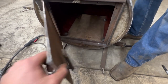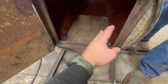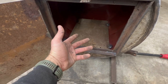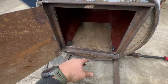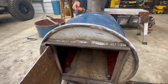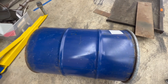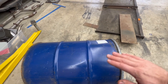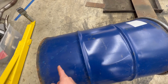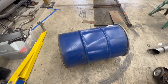We tacked a plate steel piece on all four corners to keep hot coals from ever sitting against the barrel whether we burn wood or use the waste oil burner. That'll protect the barrel and make it last. The bottom barrel is done. Now we're starting on the top barrel — I'm going to cut it to length, and I'll add a metal shelf in the middle split up to about two-thirds from the back so smoke has to travel forward then back to the stovepipe.